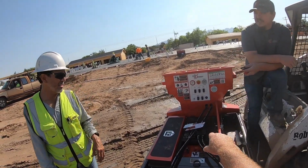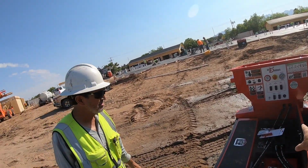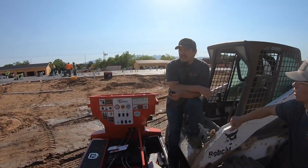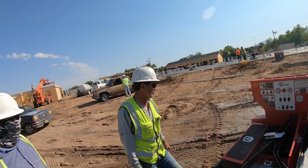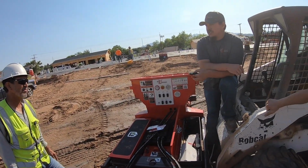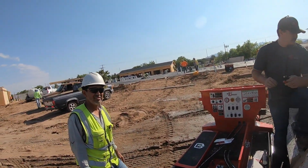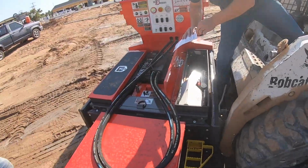You've got a voltage meter there, so it'll tell you where the charge is on it. If it starts dropping to 11.5, it'll start acting funny. So if your battery runs low, you know what it is. You could probably just get a solar charger for when you're done. That's what we're discussing now, the 12-volt options.